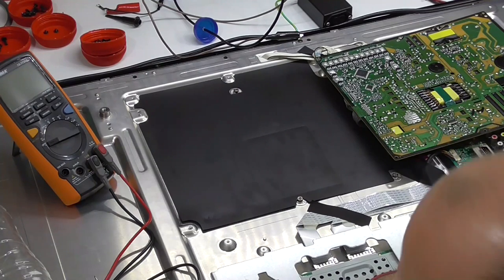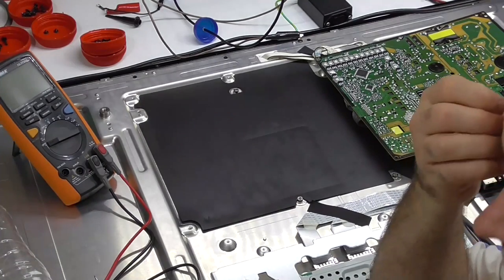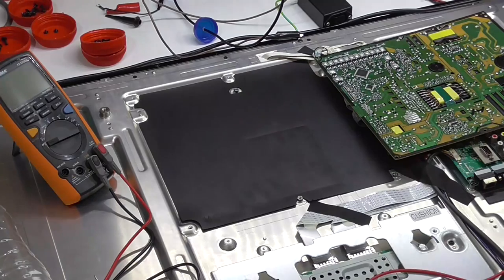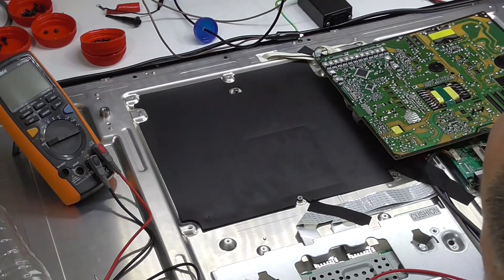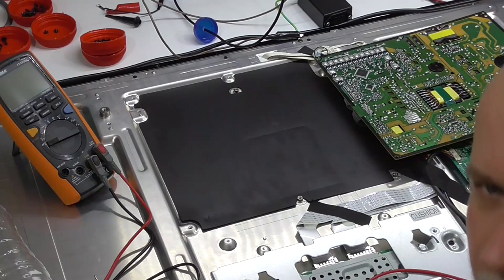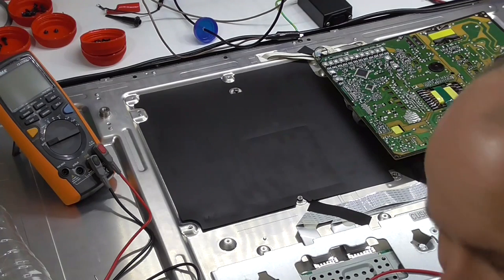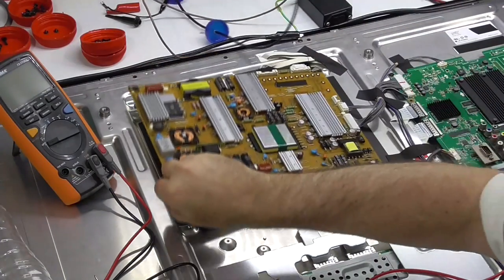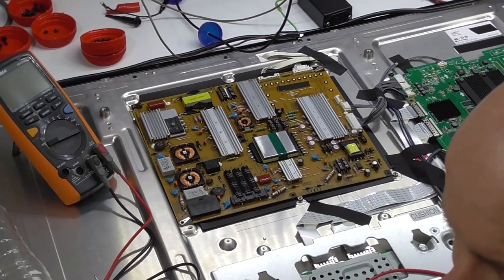I've pretty much reversed the major portion of the backlight LEDs power circuit, and it's become obvious there have been some misconceptions along the way. For some reason, I thought the backlight LEDs were running off 24 volts. I've tried to go back and figure out where that happened, but for the life of me, I can't. There are two dead giveaways. One was when I traced the circuit out: it wasn't a buck converter, it was a boost converter.